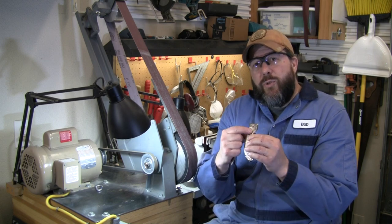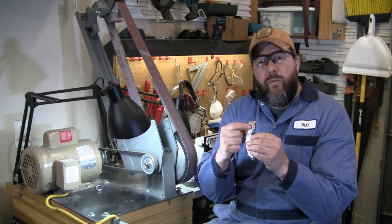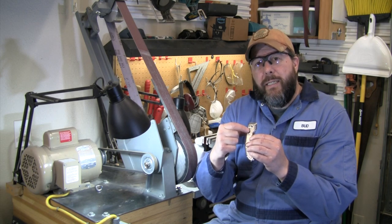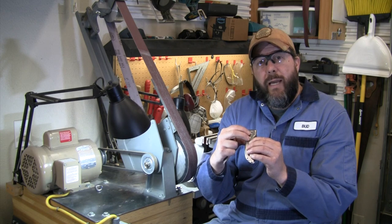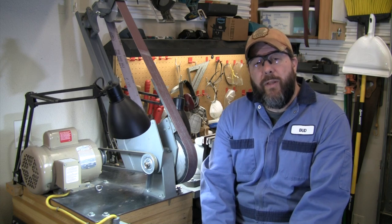So in order to drill and countersink the holes in there, we're going to use the Tormach. So I'm going to set up, we'll put an aluminum plate, we'll cut our groove in there. I'll have a couple of extra screws on the outside of that where I can hold the cover plate in place on the side where there is not a screw. And then we'll be able to drill around there, countersink them, and then we'll screw it down with those actual screws, and then we'll use that to engrave. So anyway, that's sort of the rough process. We'll build that out as we go.